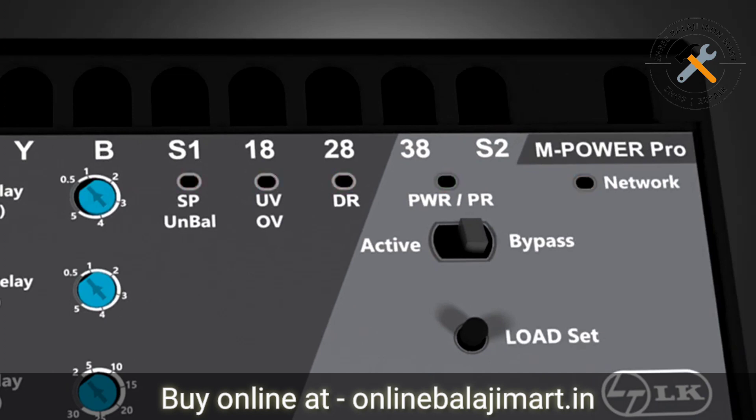These are the LEDs for a variety of indications. Most of these LEDs are used for a dual purpose. This is a power on LED and is also used for phase reversal indication, while a steady glow indicates voltage single phasing and voltage unbalance. A steady glow indicates voltage single phasing fault while continuous blinking indicates voltage unbalance fault.